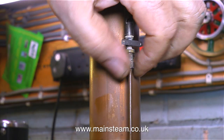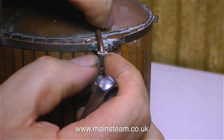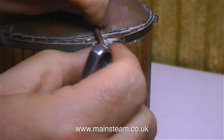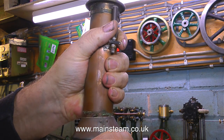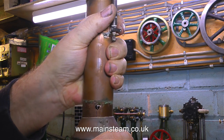There's a small whistle on the chimney, currently piped to a valve on the boiler. This needs to be disconnected. You can get problems when undoing union nuts on pipes of this age - sometimes if the pipe is stuck to the union nut, as you undo it the thin pipe will also start to twist, and then it will kink and break. Luckily I didn't have that problem in this case.